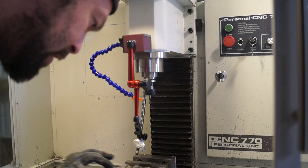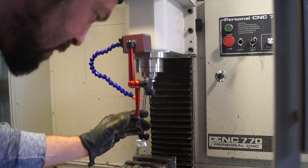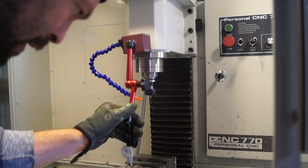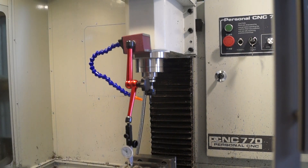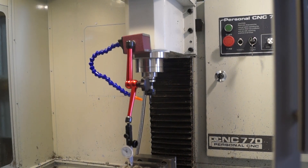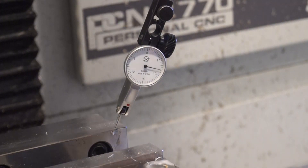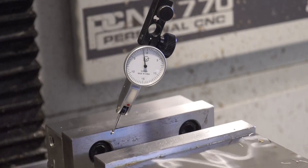Maybe the inside jaw would be smarter — everything should be parallel. I'll do it on the inside jaw because let's just not do dumb things today. I went back and forth tapping and measuring until I had just the tiniest fraction of change between sides.